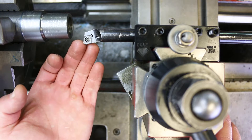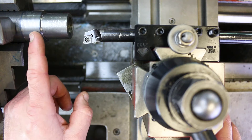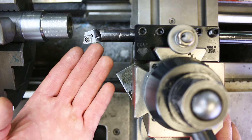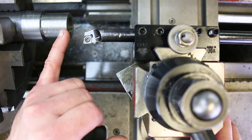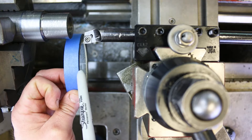The depth needs to be set in a slightly different way because the boring bar is going to be all the way inside the part, hidden from sight. We need a way to tell where the boring bar is without seeing it. We could set up a dial indicator on the carriage, but the problem is people get so fixated watching the dial indicator that they're not looking at the cutting tool, which causes issues. So what we've started doing is using a piece of tape and a sharpie mark as a visual indicator of where the bottom of the hole is. It works pretty well and keeps your focus on the cutting tool.